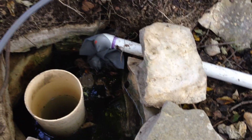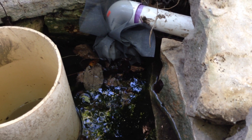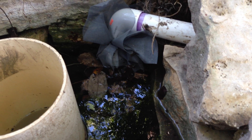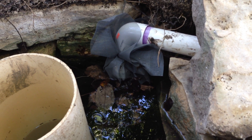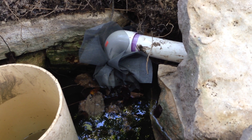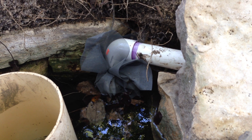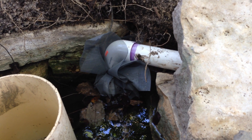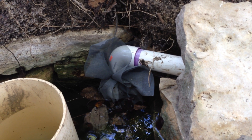Actually, I'm utilizing a little bit of siphon on this. This has completely stopped the overflow of the well, which is good — it'll allow things to dry out. But I suspect the next time we come out here, the pump will have stopped and it'll be overflowing again because this will probably lose suction. So we'll have to put a throttle valve in at some point to slow down the flow.